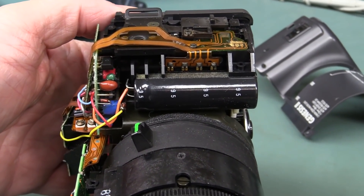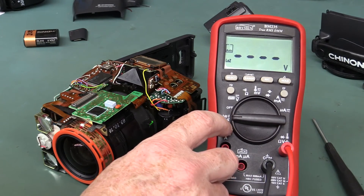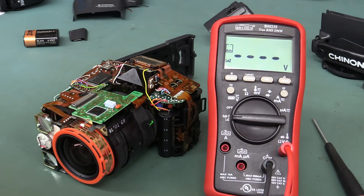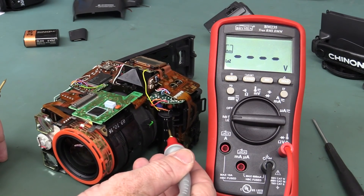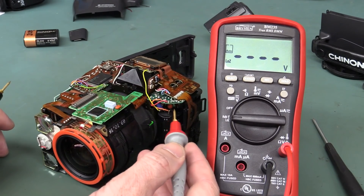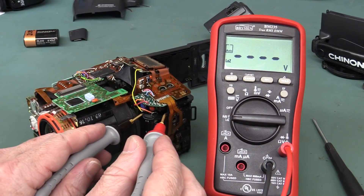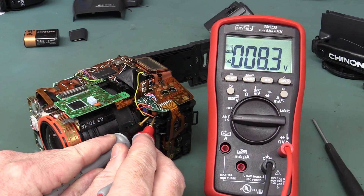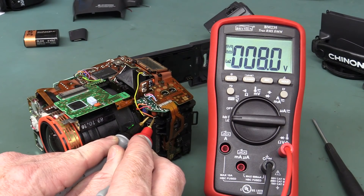There's our flash cap — no touchy. So what we'll do is discharge that — put it on the low impedance range of your meter, and that puts a low impedance directly across the input and it'll tell us the voltage as well. These flash caps typically charge up to 300-something volts, so they've got a lot of energy in these puppies. I shorted the thing out before just to get rid of the charge — and I like it when they go bang. So it's now safe.